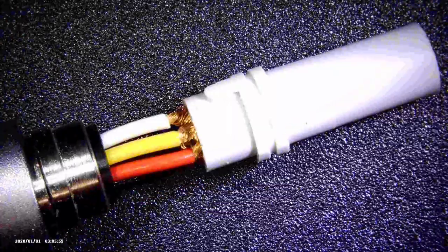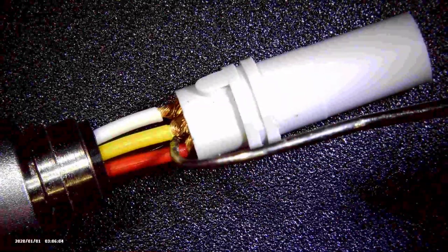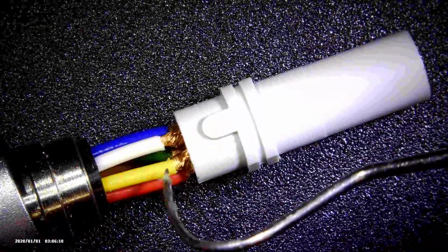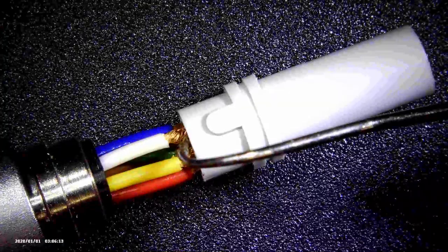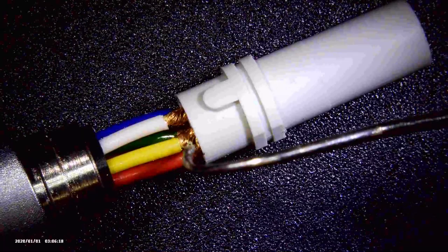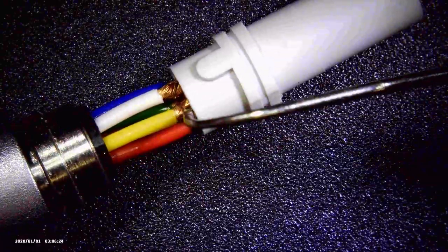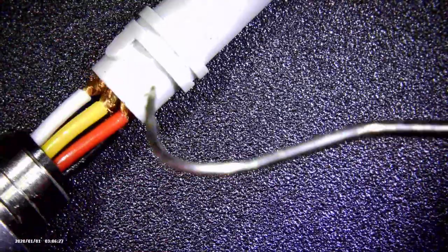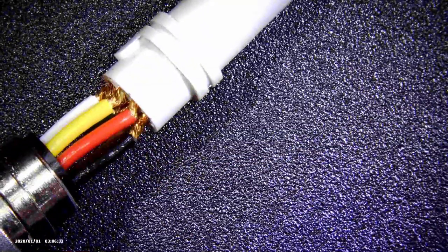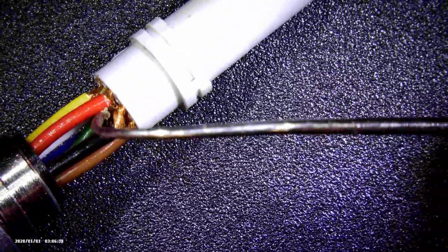The red and the yellow here — just putting them together. In between the wires we have to worry about, and we also have to worry about the green wire in the middle of the connector. This is the same process with all these types of connectors — whenever you have a little bit of fraying, all you got to do is get in there with a pick and separate out all the strands. Under a microscope it just takes a little bit of time. I've got some red copper that is almost touching the black — I believe those are the two causing a majority of the short problems.